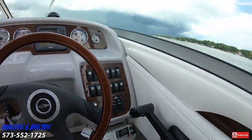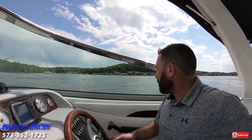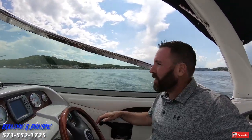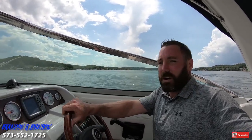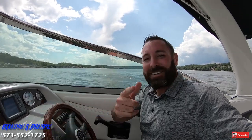So that's showing you how trim tabs work and showing you that they work. Remember, when you go to dock the boat, put those trim tabs all the way back up. If not, it'll feel like someone's holding the back of the boat and you won't be able to dock it very well. We're going to go put her back on the trailer, and then we'll do some conditional walkthrough of the inside outside and finish up with some drone footage. Thanks for watching.